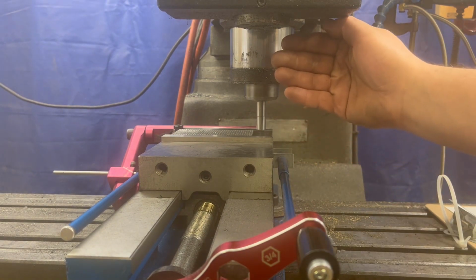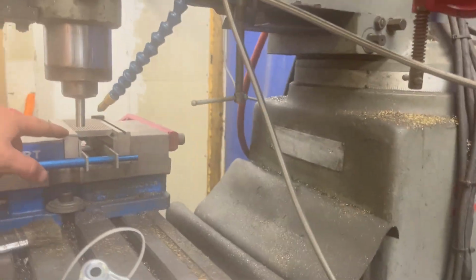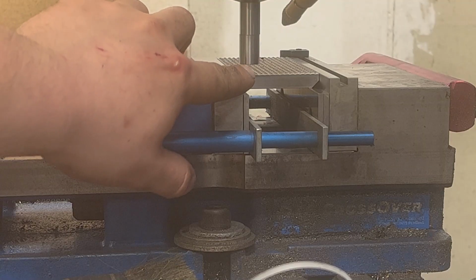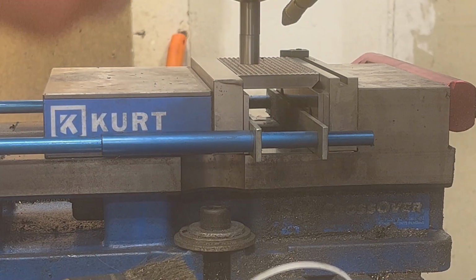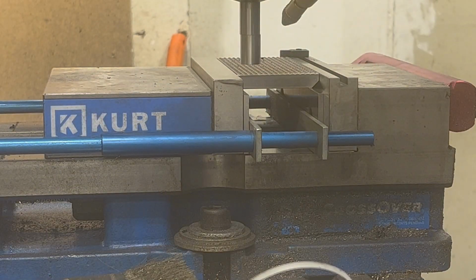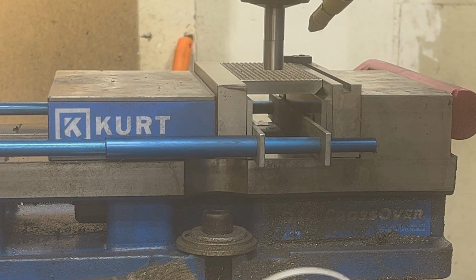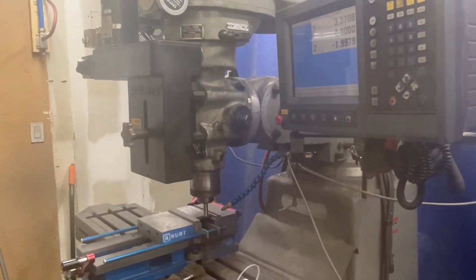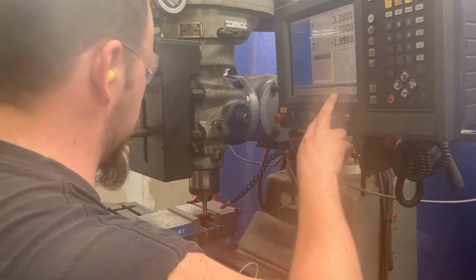We just found the edge of the part, right? Put you here to explain better. So we're already the radius into the part, 250, because we're talking center line of our spindle. That is where our point is at. If you think of a coordinate system, we're already 250 in. We're just going to go 500 in. And once we're 500 in, is 0. And we're on our 750 mark. I'm really enjoying this because I talk to myself anyway. So this makes it a little more understandable.